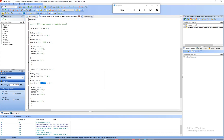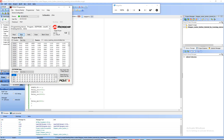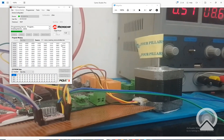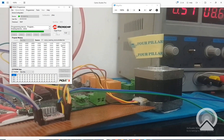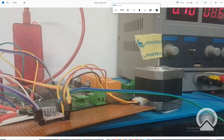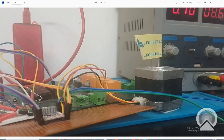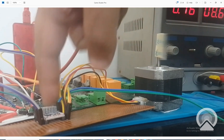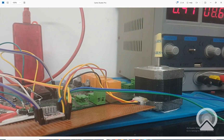Build the code - it's built. Click Write; the new code is being written. Go to the hardware - it's starting because it's programming and receiving random pulses. Now both buttons are active. By default the motor is not working. This is the right button and this is the left button. I press the right button and it goes for four rounds and stops.